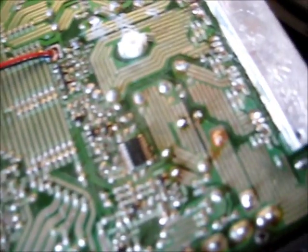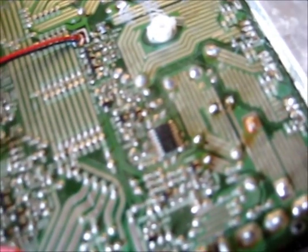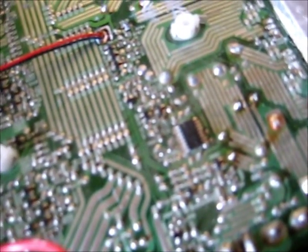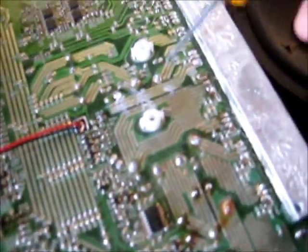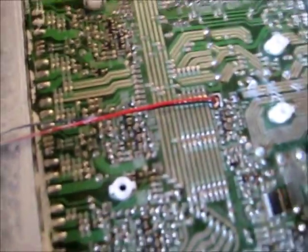The power does come on and everything runs fine without the amplifier connected. It's just that last leg there that's shorted out. The rest of the power supply is fine — it's just something in this area that's shorting that last leg out. But the amp runs with it under stress. Something in this part of the circuit area is shorted. If I were able to trace the fault down to this part of the circuit somewhere — or it could even be here. Getting there.